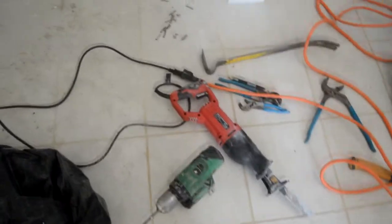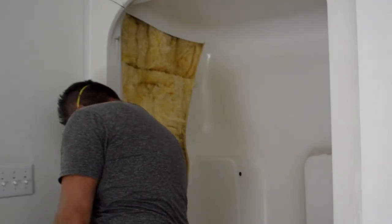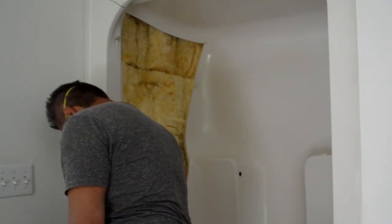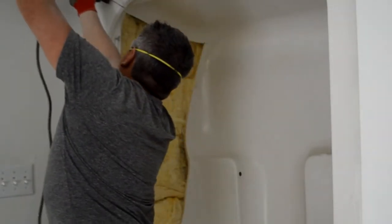You need to be cautious when you're cutting, especially if you're going to use a saw or a reciprocating saw. You want to make sure that you don't cut that deep and you cut in a slanted way, so you know how you control your cuts, right? Even so, you need to be constantly looking inside the walls and see if you can guess what's going on there before you continue, because sometimes there is nothing in the walls.